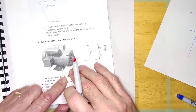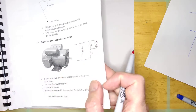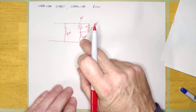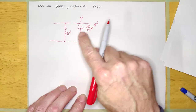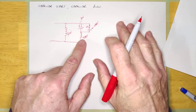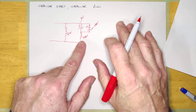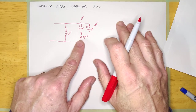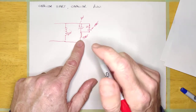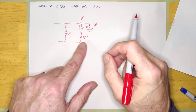The third kind is the capacitor start capacitor run — the best of the best. It's going to have tons of start torque and improved running torque because of a smoother rotating magnetic field. There are other motors out there with and without centrifugal switches. All single phase motors are going to have a start winding and a run winding, and some will have the centrifugal switch to take the start winding out. Your instrumentation pump run by a VFD is a motor with no centrifugal switch — it has a start winding in there all the time, because with a VFD there's no guarantee of enough speed to open a centrifugal switch. It's an optimized motor for VFD use.